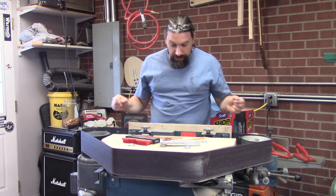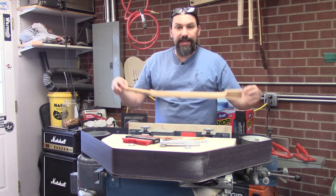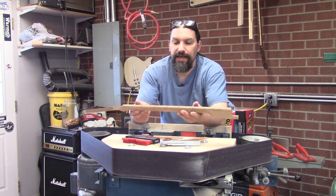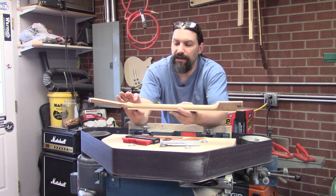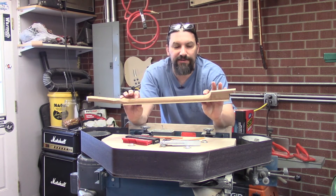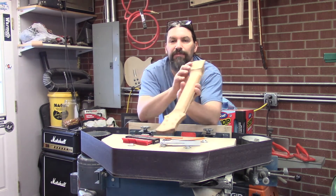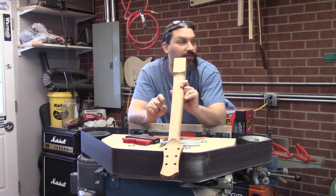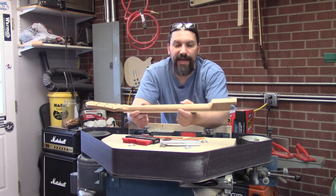What we do is go from a big blank of wood to something like this — jumping ahead several steps obviously. The fretboard is radiused, then we cut the neck out and get it to rough size, which is about 900–920 thousandths at the nut and 950 thousandths around the 12th or 14th fret. We go ahead and lay that out, put a round over on it using a jig on the pin router. Necks started to look like this and we had a bunch of them — they went really fast.